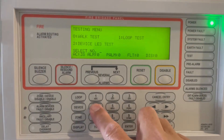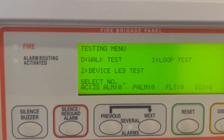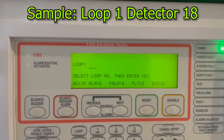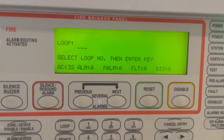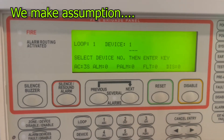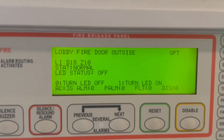Select test four to look for a device and test it. This time we're searching for detector 18. As I mentioned, my example is we are searching for a missing detector 17, so to find 17 we look for 18. Select loop one, press enter — I want to know where 18 is so I can search nearby for 17. This is for fault finding.